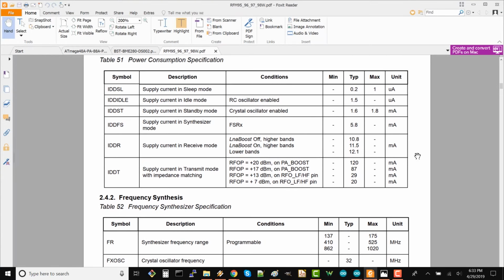We've made some great progress, but there's now one thing that concerns me. We initially set the transmit power on the RFM95 to 17 dBm. The most an RFM95 can go is 20 dBm, which is 100 milliwatts. If it is really power, then I would think that as voltage goes down, current usage should go up, as power equals voltage times current, at least for resistive circuits. I'm gonna have to dig into this a little more, as we need to make sure the radio still has the same range after lowering the operating voltage to 1.9 volts, but that'll be for another episode.